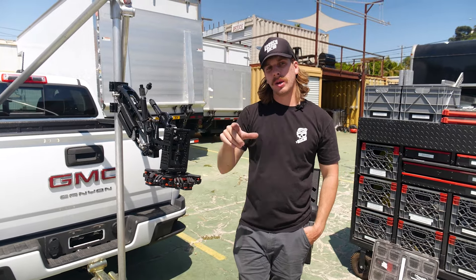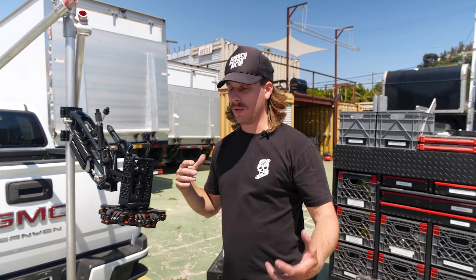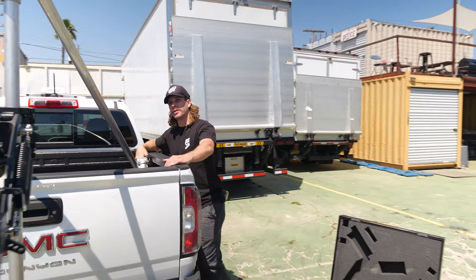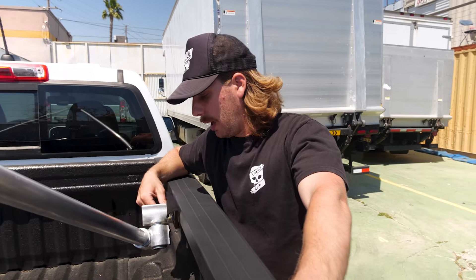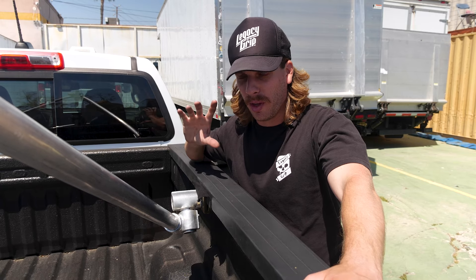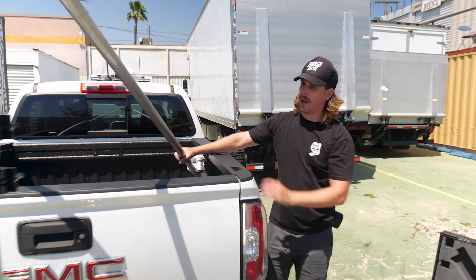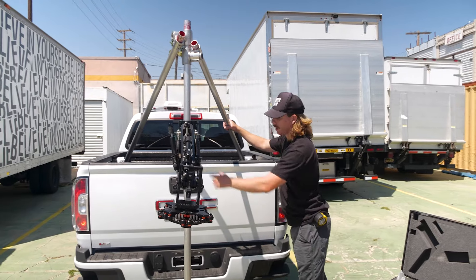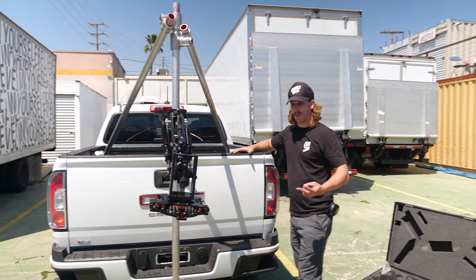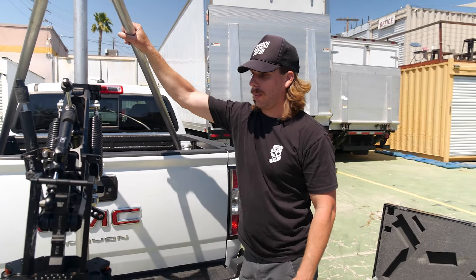This is all rigged up. Let's talk about safety — it's so important. What I'm thinking about here is whether these unibody clamps will slide. These are just pinch clamps, and as a sole point for the triangulation, it would worry me in a worst-case scenario that they slide, in which case the vertical pipe would also move. If I was to do anything different on this, I'd attach a suction on each side and triangulate to these two pipes again. That does two things: it makes sure the unibody clamps can't slide, and it adds further stability to the rig.